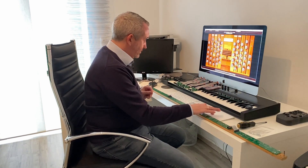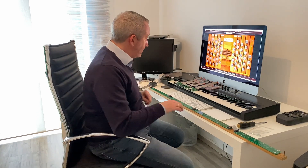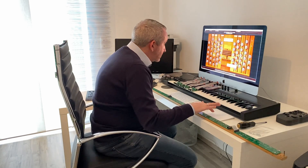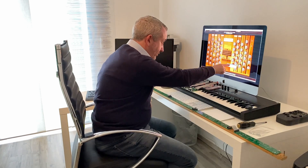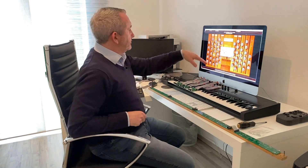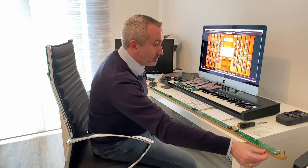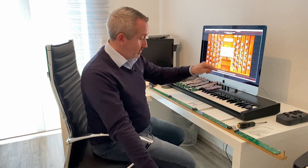If you can see the screen, there's the pedal department. I want to tell the pedals that MIDI signals are coming from this line of electronics. If I right-click, there are three options — I'll choose 'Auto detect MIDI triggers for number one pedal.' It now says: play the lowest key (lowest C), play the highest key (highest F), and any keys in the middle. When it's recognized what's going on, it will flash 'done' in blue. I take the magnet to the lowest key until I see the red light, then trigger the highest key — it's registered both.